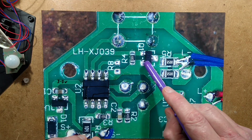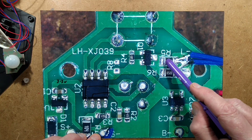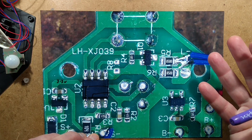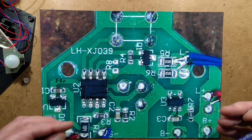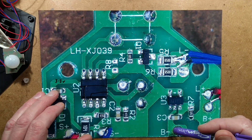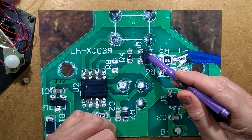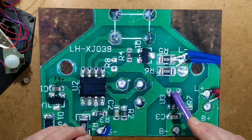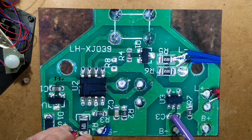It's got the transistor here switching the output via these shockingly low-value resistors — these are 0.5 ohm each, two of them in parallel giving 0.25 ohm. That really pulls the battery voltage down dramatically. In fact, if you connect to a bench power supply and adjust it to 4.2 volts at the battery contacts, it's passing 1.5 amps. This little A2SHB MOSFET gets very, very hot indeed — it is not happy at that.